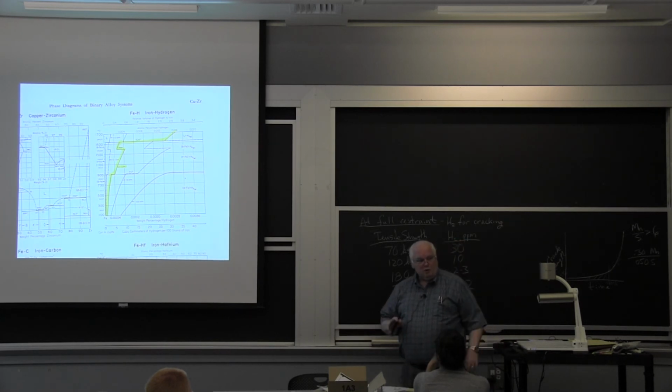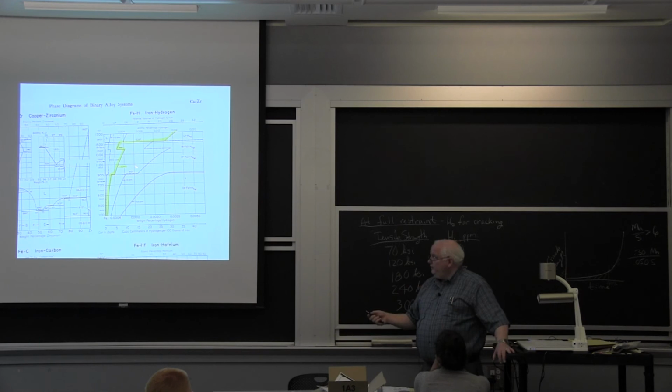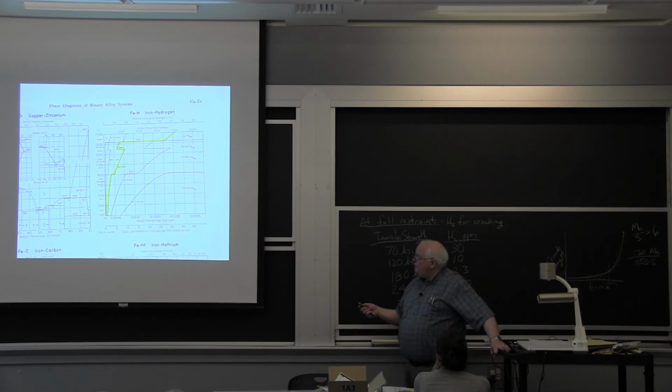When you're underwater welding and your atmosphere is 60% hydrogen, well, in theory, if you look at equilibrium thermodynamics, 60% hydrogen, you should only get about 70 or 80% of the amount of your 1 atmosphere. This is for 1 atmosphere of hydrogen in your shielding gas. Now, if you're down 300 feet, you can get even more hydrogen. Isn't this great? Because you have a higher pressure, okay? But this is all 1 atmosphere. So hydrogen gets worse as you dive deeper.